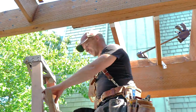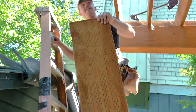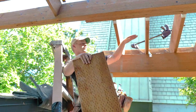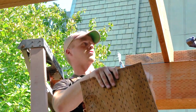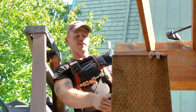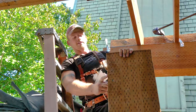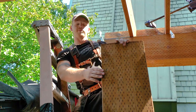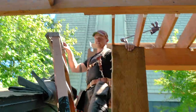We had to take this out — our notch was off. This one wasn't graded, so all of our joists are graded by height and this was our shortest one, but it was too tall. So we had to take a notch out to sit it on the beam so our joist would plane. The notch wasn't deep enough, so we just had to take it out, take that notch deeper, and then it'll sit down and we can attach our rims.